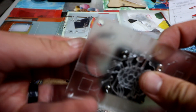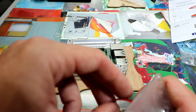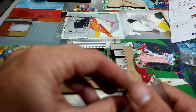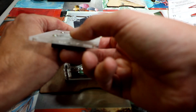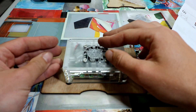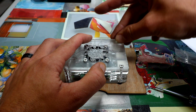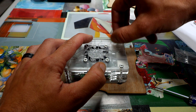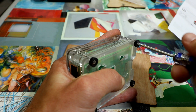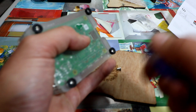Pin 6 on the back is a ground — that's the third pin down on the back row. We're going to put it on there. You have two options: five volt or 3.3 volt. 3.3 volts is the corner closest to my finger, and those two back row pins are both five volt. I'm going to go five volt because I want maximum performance — fan noise doesn't really bother me. You need to navigate that cable underneath that last plastic piece to really get this thing to settle properly. Watch out for that wire if you're having any flexing on the top.